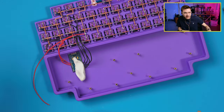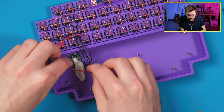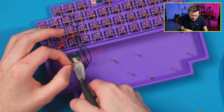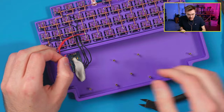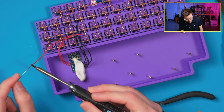Just notice ZMK's battery calculator. OLED display drains so much. Yeah, OLEDs are not efficient. That's why nice!views exist, if you can find them in stock, and if you're willing to pay like 20 bucks for them. They last a lot longer. If you switch it to nice!view, you'll see that they don't drain as much as an actual OLED display. OLEDs kill your battery.